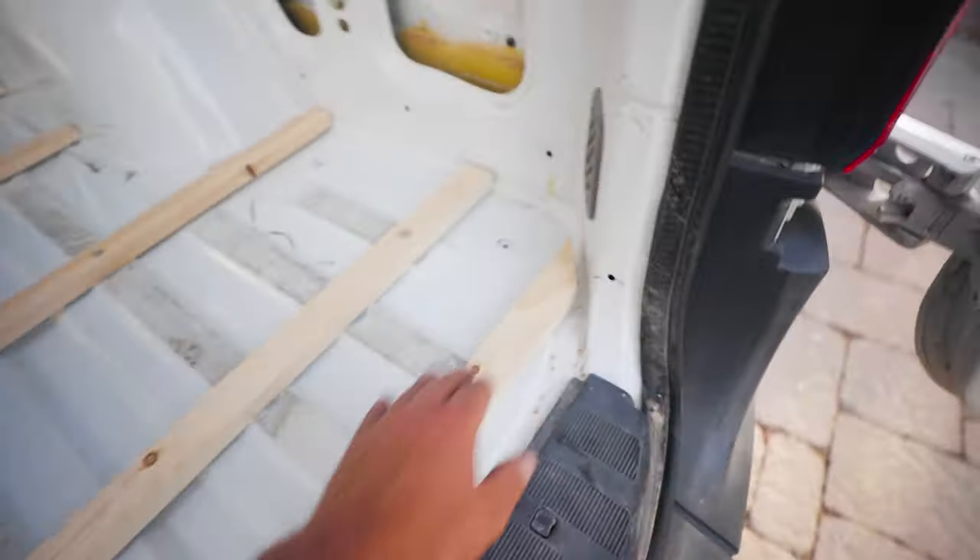Many hours later I finally have the bulk of this done — all the horizontals, with screws counter-sunk and self-tapped right into the frame. I cut one extra piece at the back so the floor goes all the way to the end, and did a little bevel cut to match the trim of the Sprinter van. I wish I could just finish and throw it all in, but I want to leave time to edit and show you guys the progress, so I'll show the finished product in the next video. Thanks for watching — drop any questions or comments below. Welcome aboard to all the new people who joined. We're getting close to episode 50, which is pretty crazy. Don't forget your safety goggles — take it easy and I'll see you all in the next episode.